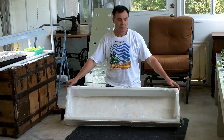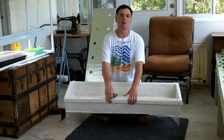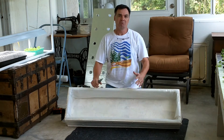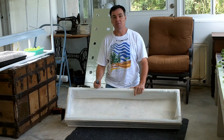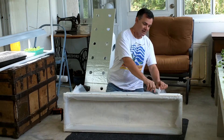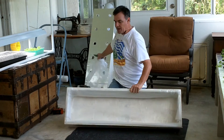Now that we have our sides on, we're going to take our razor and just trim off the excess. What I did on that first side is I put the edge right where my lath would be so I didn't have to worry about trimming that side. This is a little bit looser than what we've done with other ones in the past, but when you're doing it on your own, sometimes you just can't get it as snug. You can use duct tape to hold it in place, or the best thing is a second pair of hands. Using a razor, be very careful, keep your fingers out of the way, and just take it right on the edge of the lath and run it across. That cleans it up really nicely.